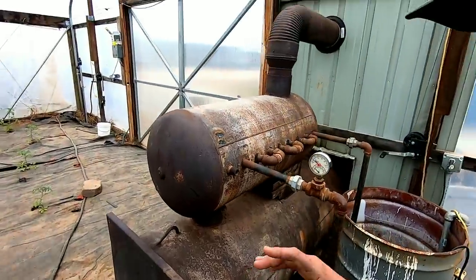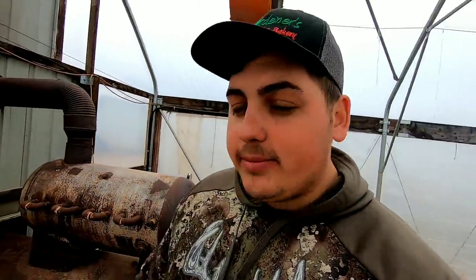With this wood stove burning at max capacity full, the hottest I ever got it was about 30 degrees warmer than the outside temperature. It works pretty good this time of year — the low temperatures are in the mid-20s up into the low 30s. I'm able to keep the high tunnel here about 65 degrees all night, though it does fluctuate. With the wood stove, I've got to wake up two to three times a night to come put wood on the fire.